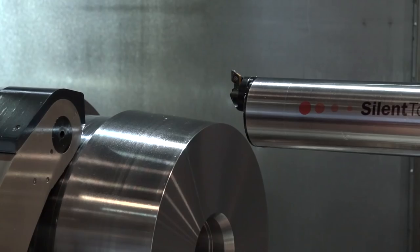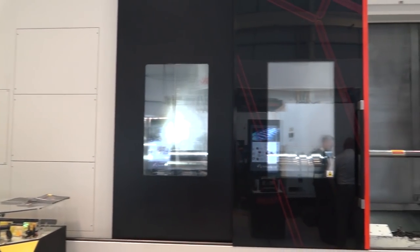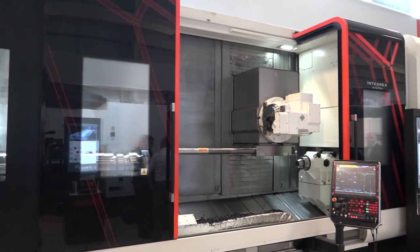What's the ratio you can use? We have introduced a standard offer from the first of March this year — it's from 60mm, 80mm, and 100mm diameter up to 10 times D. But we also have the engineered solution where we can extend the limits up to almost 18 times D in overhang, and diameters from 100mm and above. That's incredible. Three years ago the maximum overhang was around 14 times D, but by increasing the knowledge and utilizing the technology we have expanded this limit up to almost 18 times D in overhang.